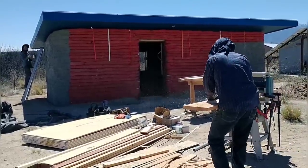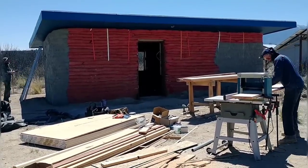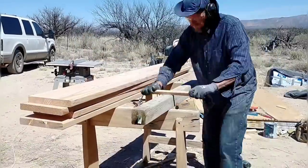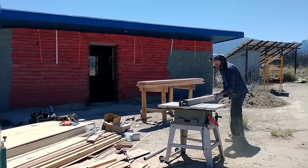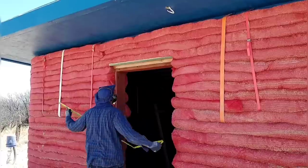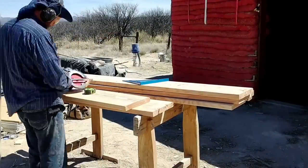I'm working on planing some of the wide boards we're using to reinforce this door frame — they're 12-inch wide boards and it's quite a struggle to get them through, as the blades are getting a little dull. We want the finished door frame to be close to the thickness of the walls. The walls are 18 inches thick, so we're using a 12-inch wide board and will be adding a 2x4 to get to about 15 inches width. We didn't have any treated 2x4s handy, so we decided to rip a 4x4 in half — these are treated 4x4s left over from the footer framing of our house, so it's good to reuse the material. Now that the boards are the right thickness, I'm measuring the lintel piece and getting ready to cut it to length.